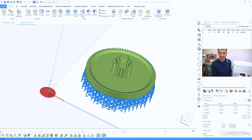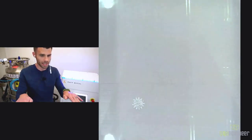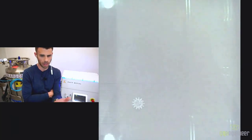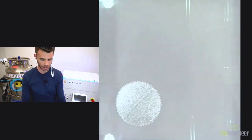While it's printing, the machine is actually taking images of the build. I'm going to show you how I know this build was probably successful — I took the images that are created and looped them into a video. What you're seeing is a slice-by-slice image of our part being built in the build tray. These are easily downloadable from the machine as part of the log files. You can see support building up at the bottom, and then the gear solidifying.